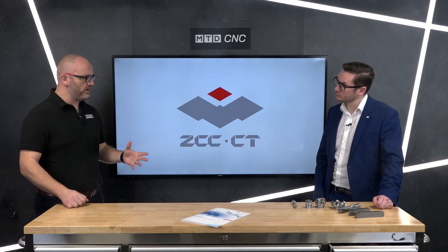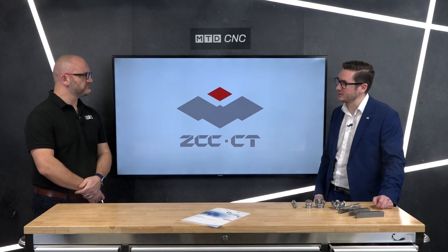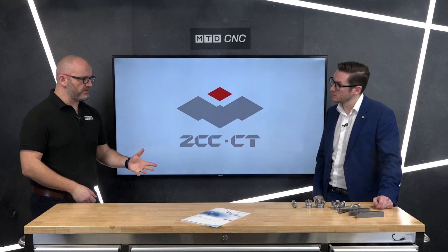In terms of the YBS, what's in the mix that makes it different? You probably don't want to tell us the chemistry, but what makes it so different? So we've got a new additive in the carbide that means we can perform a lot more stably under higher thermal conditions when we look at a turning application.